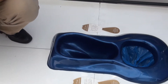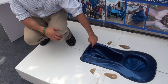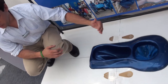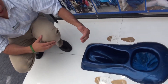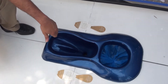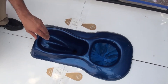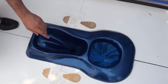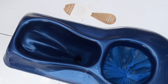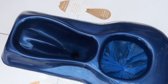We do this in three main ways. Most UDDTs have the hole at the front, and as a result, people try to aim over the hole. We found with women they were shuffling back and forth, which made it very uncomfortable, so we ended up putting it further back. Second, it's a deep hole, so that immediately reduces any chance of splash. And third, this fin here is very good at breaking the stream without any splash happening. Overall, it improves the user's experience considerably.